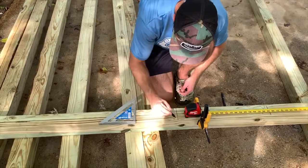Lastly, I went back and I filled in the smaller segments at the front wall of the shed, and I installed the starter trim and the vertical J trims just like we did before. And you can see there's a receptacle box right there that I cut out using snippers. I then secured the final panels in place using the provided screws and mounting the panels to the studs behind.